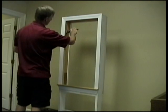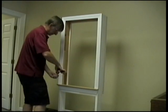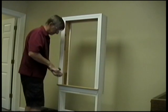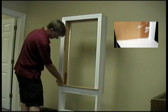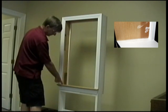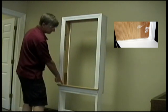Now let's inspect the existing frame. This is a great time to close up any cracks that you see. If your frame is deteriorated, it should be repaired now. Also, I would recommend that you caulk the corner joint where the side of the frame meets the sill of the window frame and the exterior blind stop.